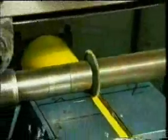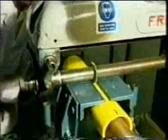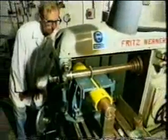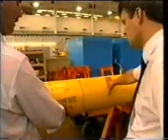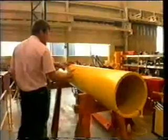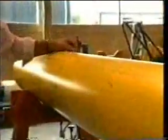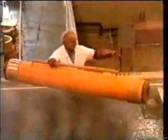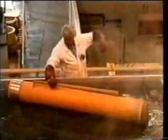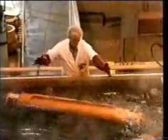Many codes of practice allow surface damage of up to 10% of the pipe wall thickness. The evaluation of swage lining included pipes with machined longitudinal notches of 20% of the wall thickness at 4 positions around the circumference. These notches have been machined before and after being pulled through the reduction die. This is to simulate the extremes of damage caused during site handling. Samples are then subjected to long-term stress rupture testing carried out at 80 degrees and 20 degrees C. This test will verify a minimum life expectancy of 50 years.